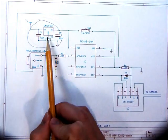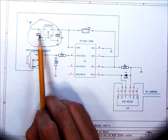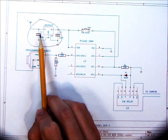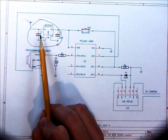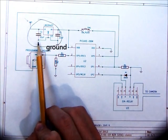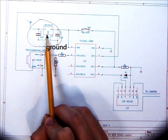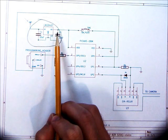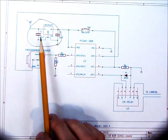This is the power regulator. The 9-volt supply comes into pin 1 on the power regulator, and there's a capacitor that also attaches to the supply and is therefore also attached to pin 1. It's got one leg going to the supply voltage and one leg going to ground. On the voltage regulator, there's the supply voltage, one leg going to ground, and the third pin is our 5-volt out. There is a second capacitor bridging the 5 volts and ground as well. So we've got three devices going to ground.